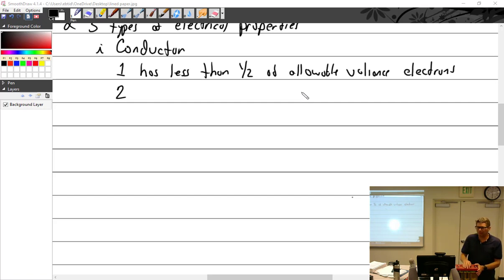If you would have taken an ohmmeter and put it between this post right here and the cable that went around it and measured that resistance, it would have been almost nothing, right? So you'd say, well, there's no resistance there, so it's good contact. I'm getting continuity. Everybody follow?